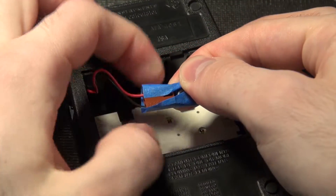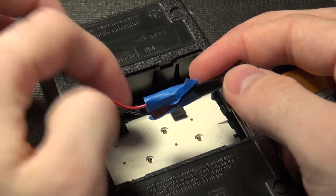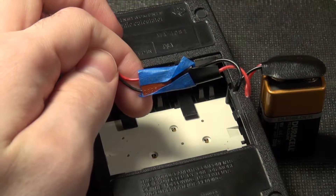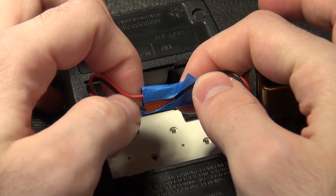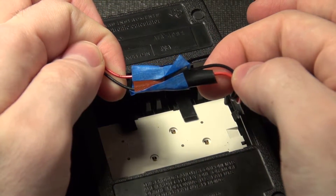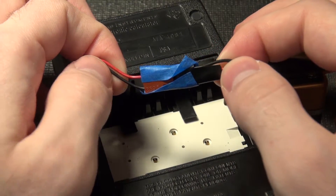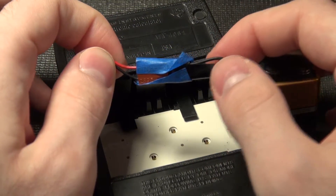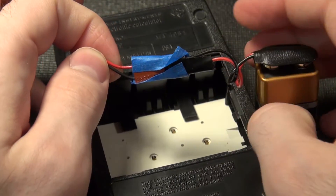As we can see under the blue tape here, it just has another connector here with a little space missing. And the trickiest part is you can't assume that the color-coding is right, because they're actually wrong — the red is the negative and the black is the positive. So it comes over here like that, because you would think it would just be standard. Don't assume. Use whatever methods you can to figure it out, or get very lucky when you power it on and nothing happens, freak out and turn it off because you are wrong.